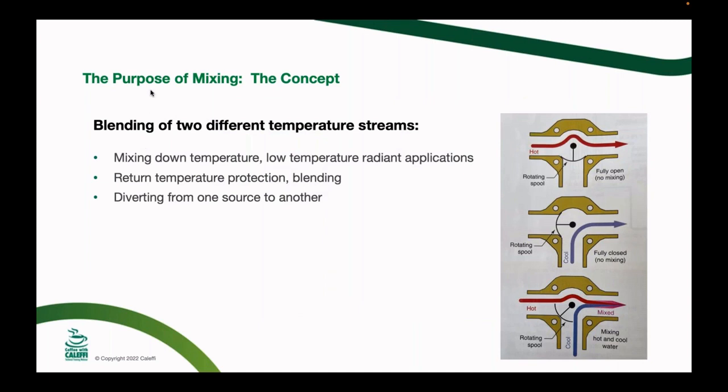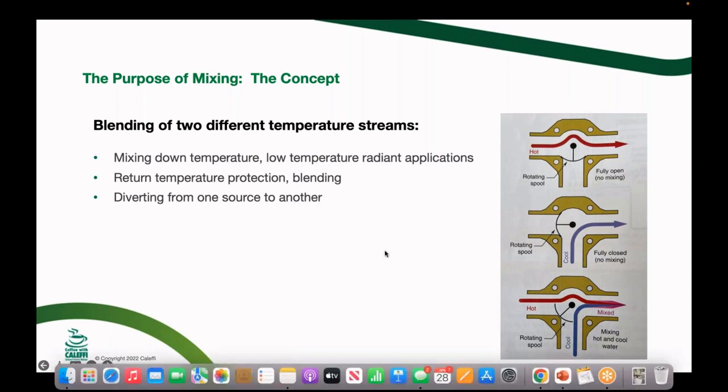It really could be this simple. Looking at these mixing valves — this is a three-way manual mixing valve. You've got a hot stream coming in on the left; there's a vane or paddle inside that just moves and changes the mix of hot and cold water. As you go down through the pictures you can see how the return coming back from the system blends with the hot from the boiler to get the mixed temperature. Just by moving that vane you can adjust the output temperature. This is still a viable product — what we'd call a dumb valve.